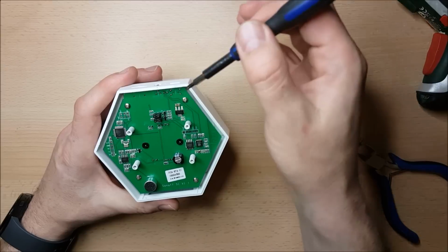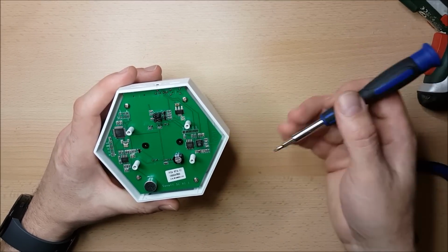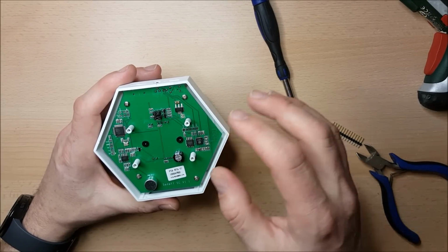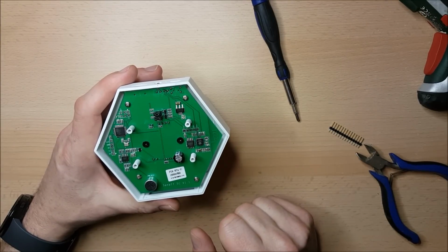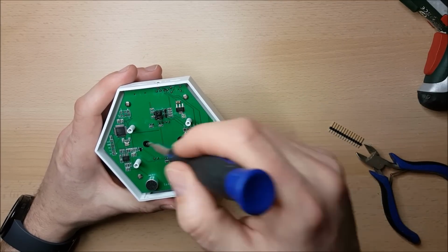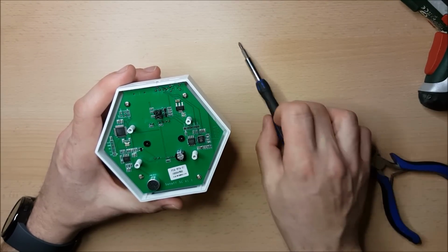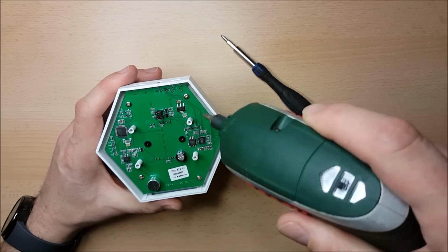And basically it talks by serial to the ESP8266, which works as a Wi-Fi bridge to allow this device to talk to IT's own servers. So we're going to be working mostly with the Arduino side just now. I'll worry about this ESP8266 afterwards. So you can see what's on the board here. The microphone here is just connected to some sort of op-amp, and then to one of the analog ports on the ATmega. So what I'm going to do now is remove this PCB and the sensors